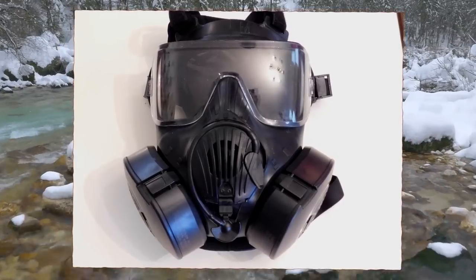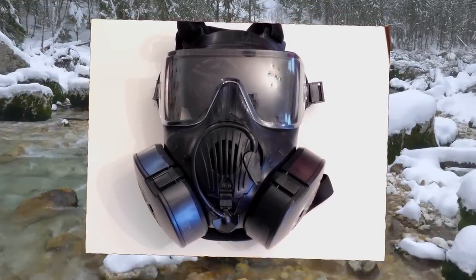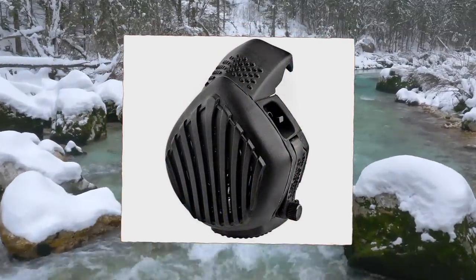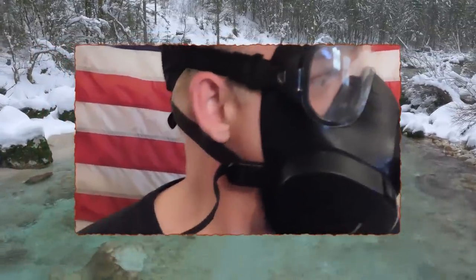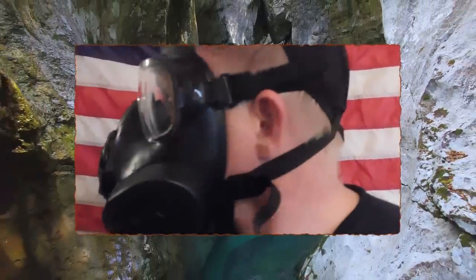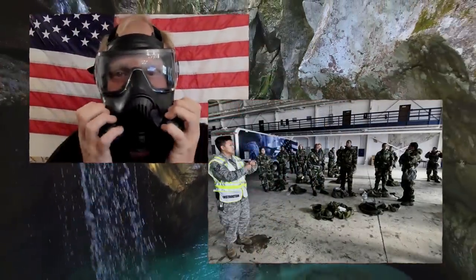It's generally available in three sizes, and the chlorobutyl rubber silicone blend gives the mask a very high degree of flexibility and comfort for extended use. It has the twin low-profile conformal filters. The unique head harness will eliminate pressure points for a more comfortable fit. An advanced reflex seal for helmet compatibility and an extended chin flap for garment compatibility with JSLIST suits.